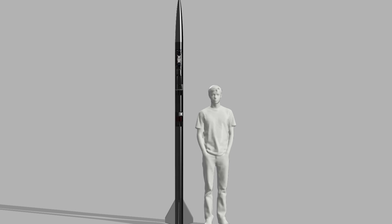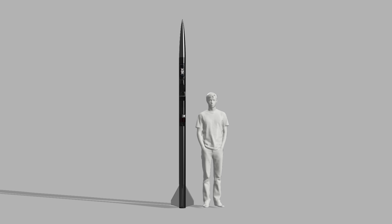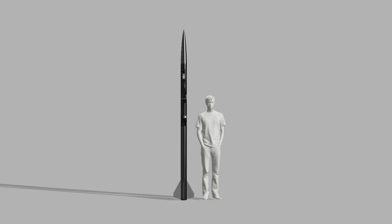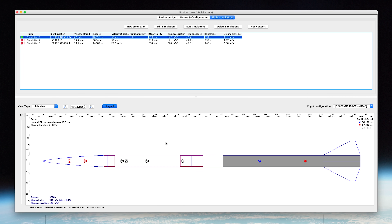I'm still building the rocket for this and am calling it Lumineer because the goal is to light the way for me to get into more high powered rocketry. The vehicle is 98 millimeters in diameter, about 2.8 meters long, and for the certification flight we're flying it up to about 10 kilometers with a max speed of Mach 1.7. We'll start by taking a look at the OpenRocket simulation here and then move over to the CAD file which is much more detailed.